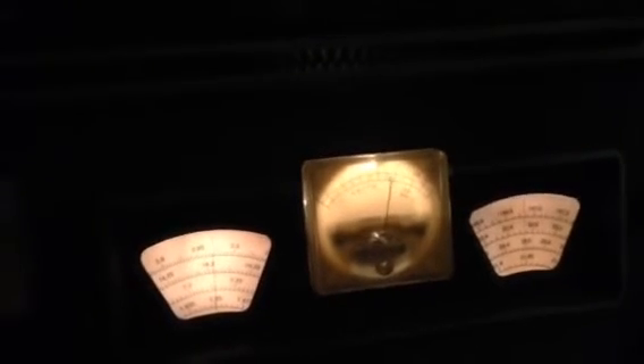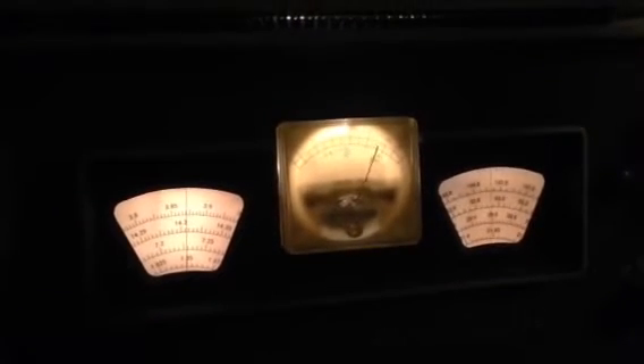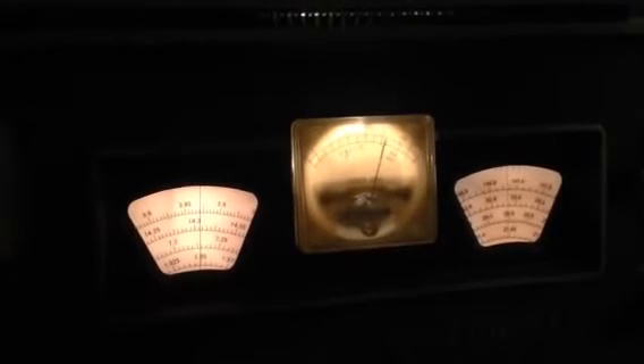Let's take a peek at the amateur radio bands and do an A-B comparison. Both radios are sharing the same antenna to an AM station on the 75 meter band, right around 3885. This is a very red-hot 170 Alpha — and this is the 200. I actually can't tell any difference — same signal strength, and the 200 might have a little bit better fidelity. Sideband-wise, the 170 Alpha is a lot better, but let's try sideband on the 200 just for giggles.